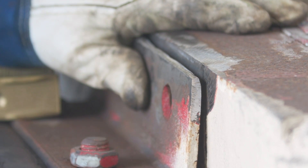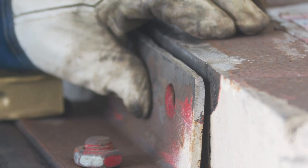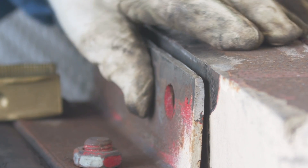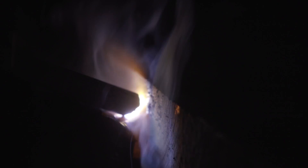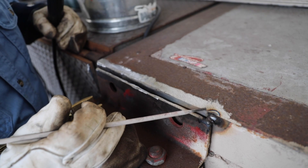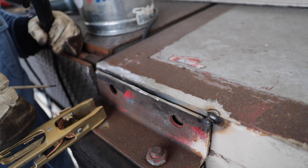All I'm going to do is just push this together — that's all it really needs. We have to strike our arc on this side of the plate because there's no ground on the other side; it doesn't transfer over. So we have to start on this side of the plate and then bridge it over and go back and forth. We'll go ahead and put one more tack down — we're going to have two tacks total. We've got that one done. We're going to jump over here and tack this side. It's going to be way easier because we're connected and we've got ground here.